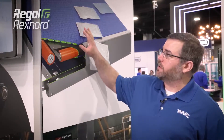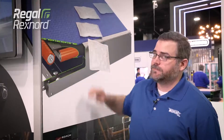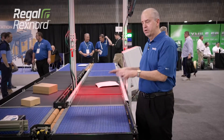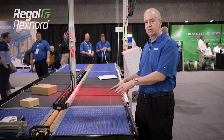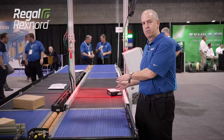So let's take you over so you can see each station along the mobile flat sorter. The standard Modsort has two 24-volt MDRs — one to run the transfer belt and one to run the divert belt. What you're seeing here is our mobile flat sorter system. We're using the basic Modsort transfer module to induct the packages into the mobile flat system.